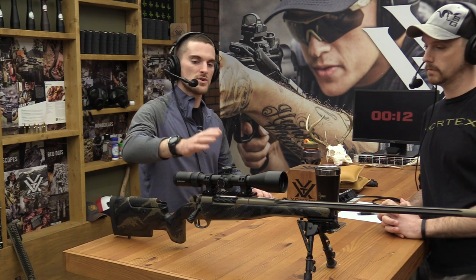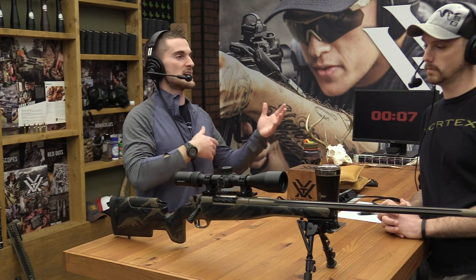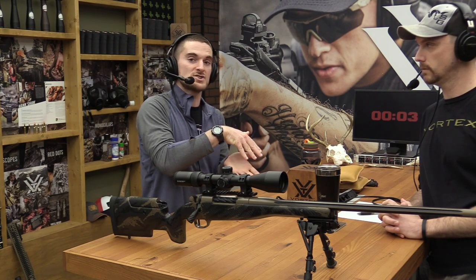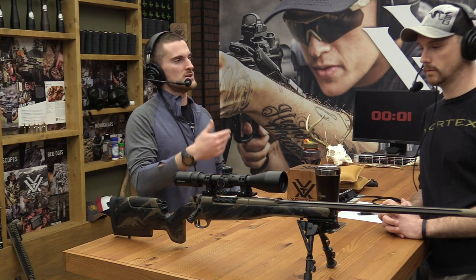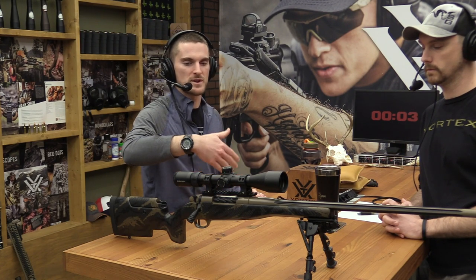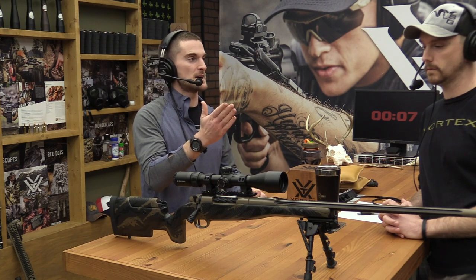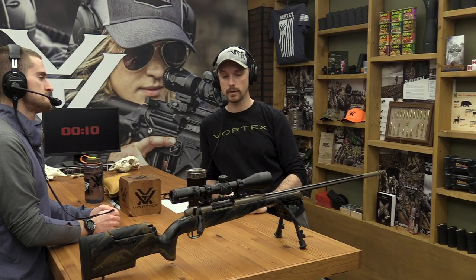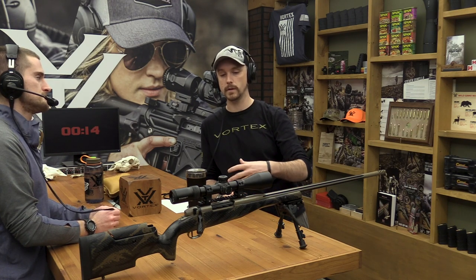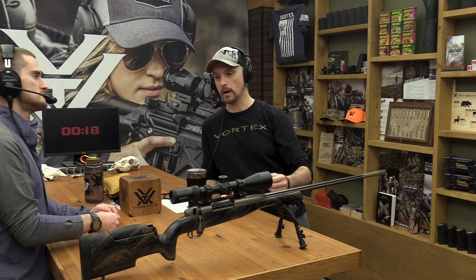And when you're dialing in tons of adjustment, we, the engineers, design in the ability for the optical system to be stretched down to its outermost or most adjusted point, where the erector unit may not be in its optical center, but it is best at its optical center. So if you threw it on there, you could have some unintended consequences if the spirit of the rifle or the build or what you're going to be doing wasn't expressly long range.